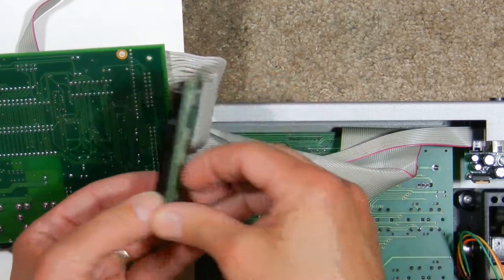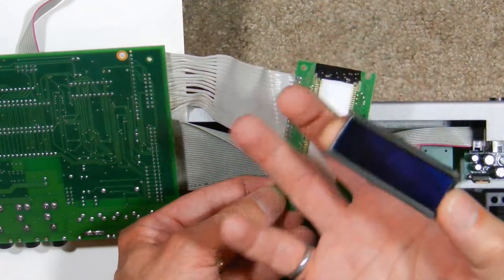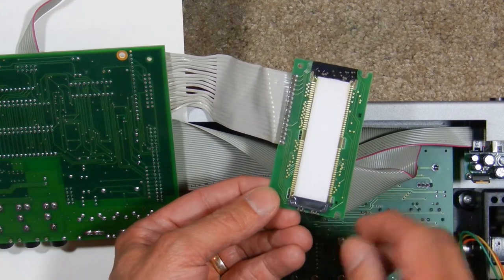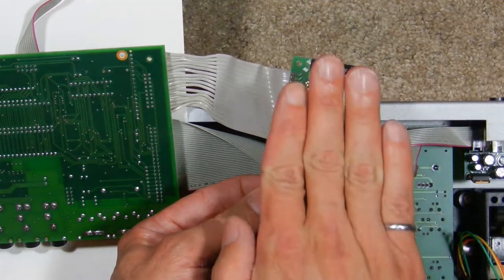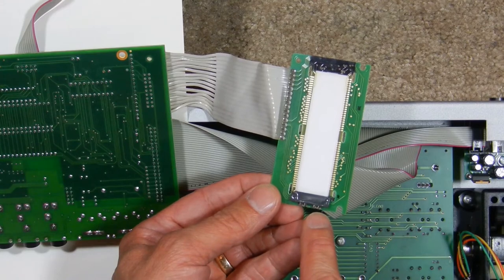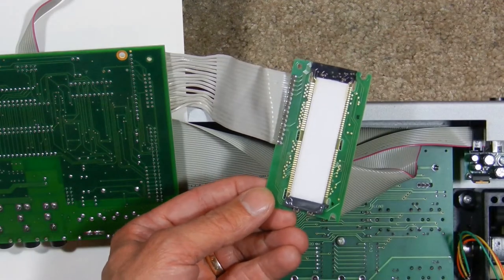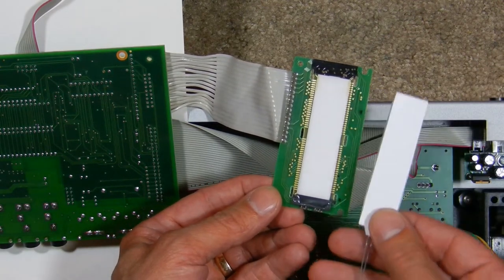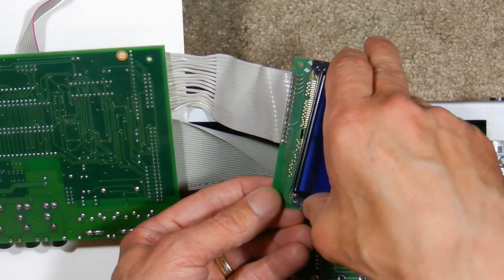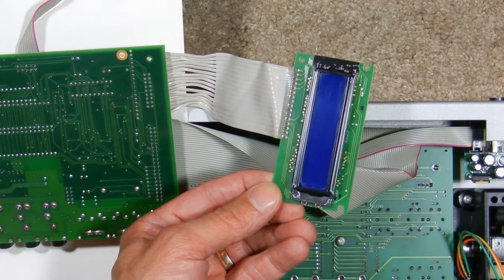What I did was on the back there are a series of metal tabs you can twist that allow you to take out the actual display component and expose the backlights. The backlight is a piece of acrylic plastic with a white diffuser over the top, with LEDs embedded at the end — when the LEDs light up the entire piece of plastic glows and makes an even backlight. I purchased a replacement backlight, so I'll remove the existing broken one, put in the replacement, put the LCD panel and overlay back in, and hopefully everything will come back to life.